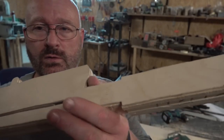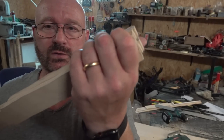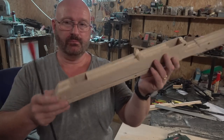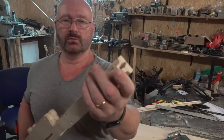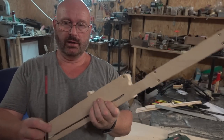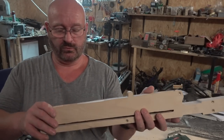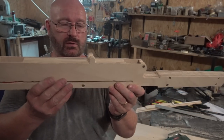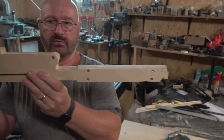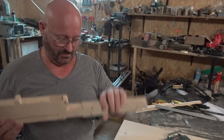When put together, this looks like so - you see room for the arrow and room for the cables, and this is where it's going to be attached to the bow. Now I've mounted the halves together and also shaped it a little bit here in the front so that it fits through the riser. At this stage it is very important that if you put in an arrow and drop it down, it goes very, very smoothly inside. Also it should not fall out to the sides, but if you tilt it to the front it needs to glide out very easily.